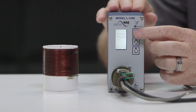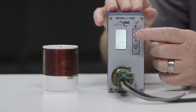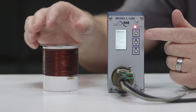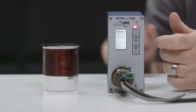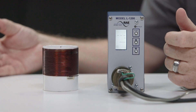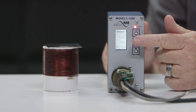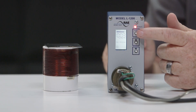Let's put a 5-second delay on the unit. Push the function buttons on the front panel for 2 seconds to exit program mode. When a vehicle enters the detection zone, the delay begins to count down from 5 seconds. At the end of the delay time, the output activates, the LED turns on, and the LCD screen should read Call. The factory default setting of the call delay time is 0 seconds.